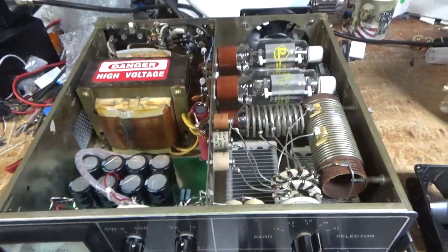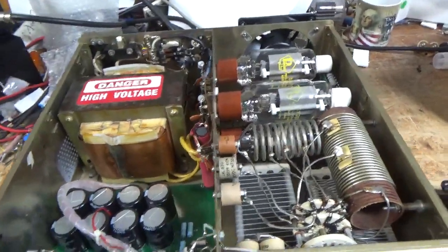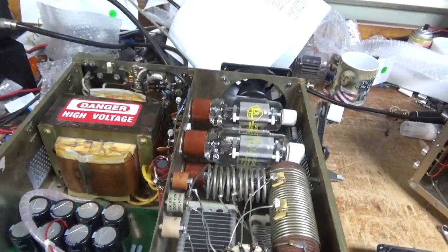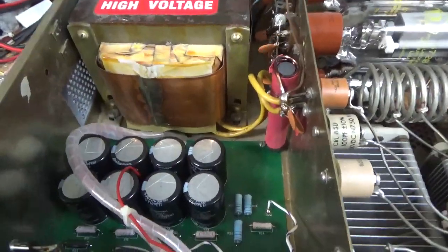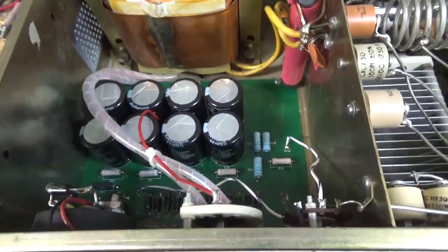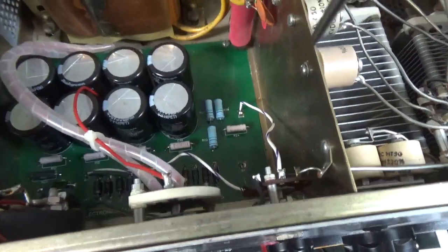Here's the inside — needed a lot of stuff. Brand new Harbach board, first off — nice. I had to assemble the board and install the board. Clean the rotary switches with Deoxit Gold. I already had diodes across the meter for protection. This cap was the wrong value, so I put the right one in. Also put internal tooth crush washers and lock washers behind the screws so they don't loosen up.